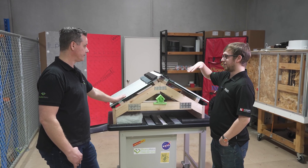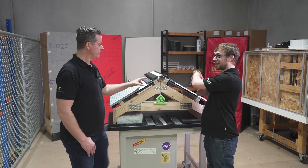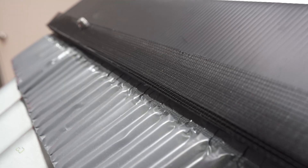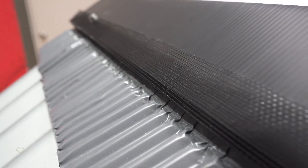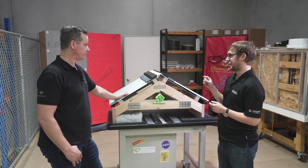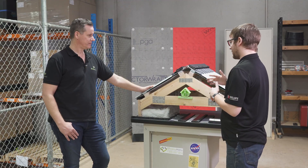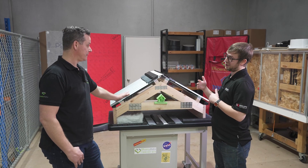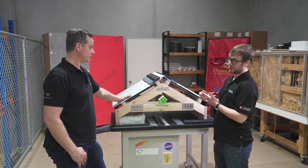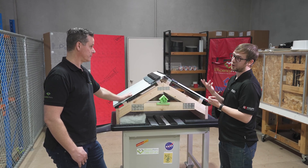Ideally the ridge would be completely closed off so wind-driven rain doesn't run up the metal and back down into the roof. The ridge vent would help stop that — which is why we have a flashing that closes those off — but when you're below 10 degrees you need larger openings than the ridge vent can provide. There has to be another way to achieve ventilation without also letting rain in, which can be quite difficult. That's why we encourage everyone, if they can, to do a warm roof situation — taking the condensation risk right outside of the structure so you don't have a risk of mould or condensation forming inside, which is where it starts to affect the durability of the building.